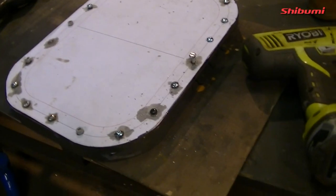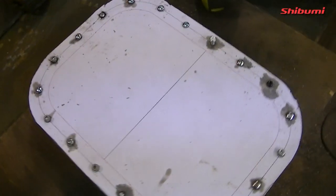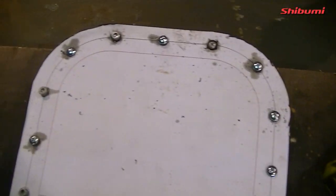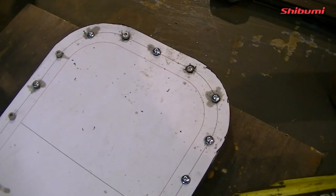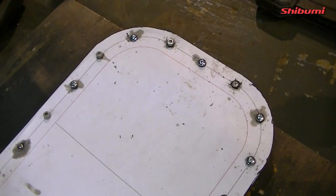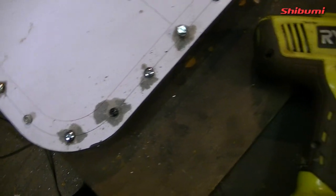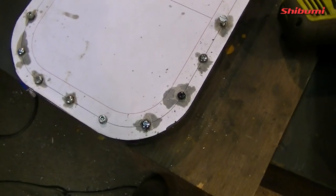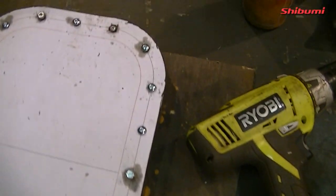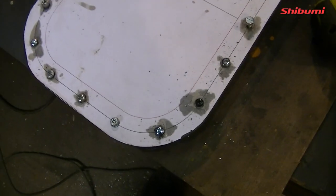I now have the seven lids made. I've only drilled them out to five millimeters and all those little screws are purely just for guides — the whole thing will get cleaned up. They're all polished on the sides. When I mount them on the actual surface they're going to be closed to, I'll maintain the five-mil hole until they're mounted and then go through with the 10mm on both, so I'm getting them exactly right. They'll be numbered and directioned — serialized — so we know exactly which one fits where, because as much as they're accurate, they're not 100 million percent.